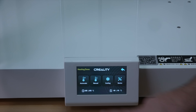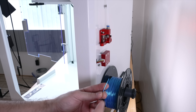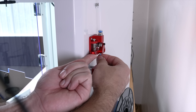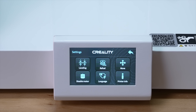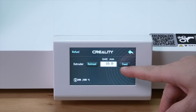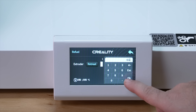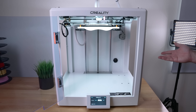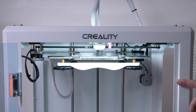Let's go to Control and click Automatic, then PLA to preheat. Now let's run our filament through — put the spool on the holder and cut the filament at an angle so it gets through the detector easily. Feed through the filament detector, then into the extruder — push the knob and you can see it coming out in the PTFE tubing. You could use the Refuel menu, but 10mm isn't nearly enough and the motor runs ultra slow, so manually pushing is much faster — takes only a couple seconds.